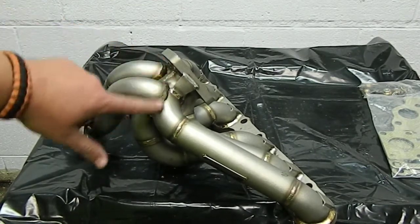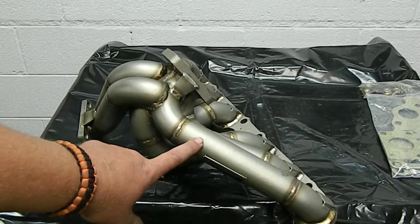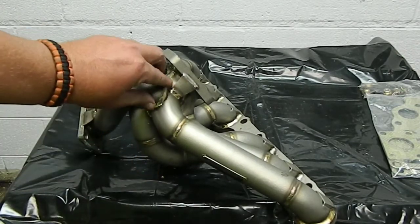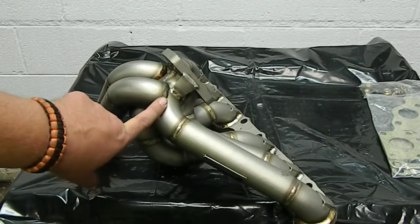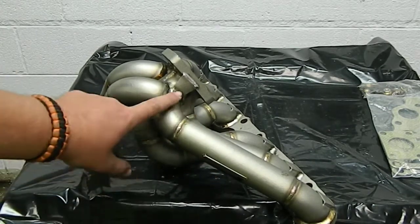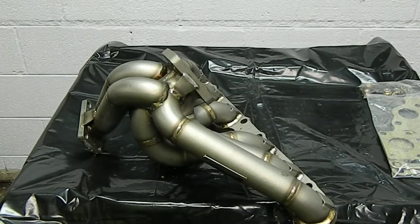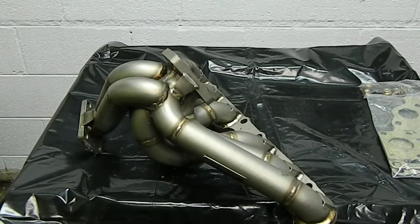All of these joints have to be hand welded, even if a company says their welds are robotically welded. It will only be the ones on straight pieces of pipe — the 90s and 45s cannot be robotically welded. So when you think you're paying $1,500 for a robotically welded manifold, the only thing that's robotically welded is the straight pieces. The 45s attached to the body — that machine won't work on those. Keep that in mind.